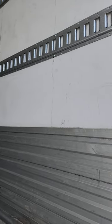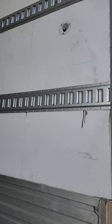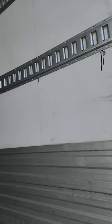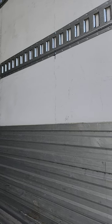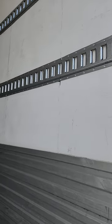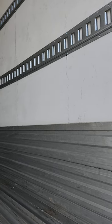When you're drilling through, sometimes your stud finder will give you a false reading, but you'll be close. You'll have to angle your drill bit sometimes to catch it, depending on what kind of brace it has. This trailer's got Z-braces, so we were off a little bit on some of them. I had to angle the drill bit once it was in there to find where the solid piece was. I cut my drill bits down to about two and a quarter inches.